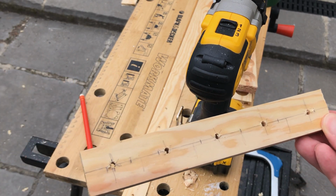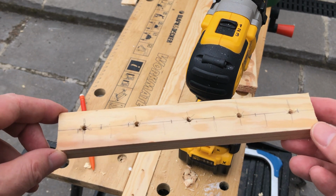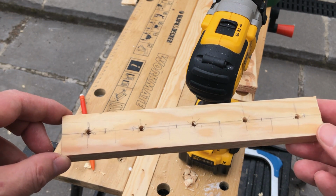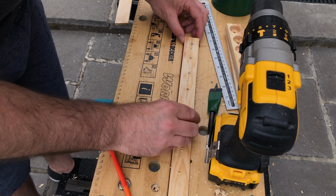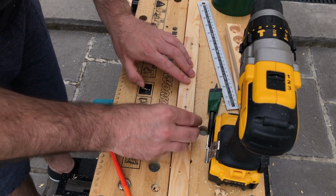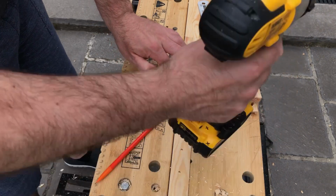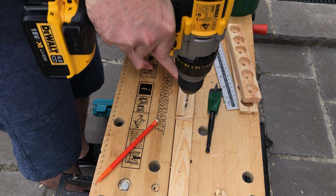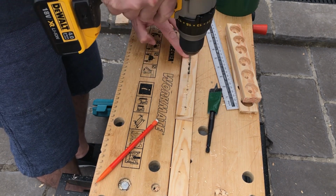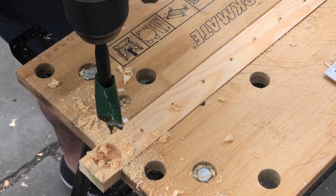And then I made a little jig with 1 piece so that I could continuously use that to mark out the next one, and use it to drill through with a 6mm bit to make a pilot hole for the larger 25mm bit. I actually had 18 shelves to make, so that took two pieces of beading. So I got it all lined up and then drilled it out in one go. And it turns out there's actually 90 holes, so you're going to be there for a bit.